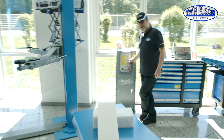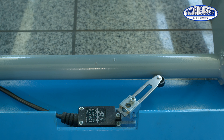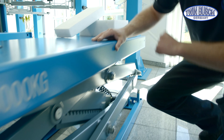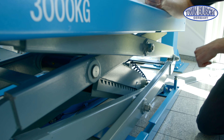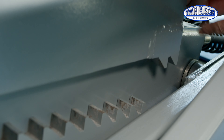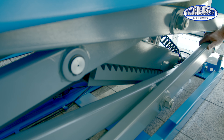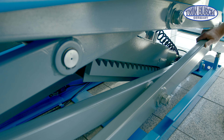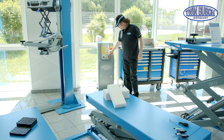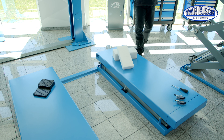I'll show you what happens. When lowering with the Down 1 button, the lift moves up briefly, unlocks the safety catches on both sides, and then lowers itself. The foot protection switch stops the lift, and with this setting it's important that it's adjusted so that the safety catches have no more locking positions downwards. Because with the Down 2 button, the lift moves down immediately. If the shutdown point had been set too early, the lift could get stuck in the lock and wouldn't lower itself.